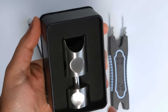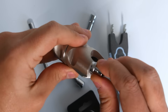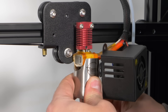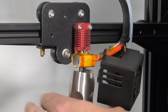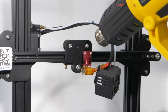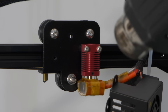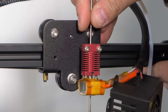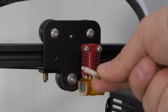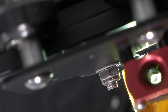I like to use the Zcatch, which is a tool I bought at IRF consisting of two sockets within each other — the outer one holds the nozzle block in place and the inner one gets a socket attached for the nozzle, which you can simply then twist. Once the nozzle is removed and you confirm that the filament path is blocked, the next step I usually take is to slightly heat up the heat break and heat sink with the heat gun, which will soften the filament jam inside. Just a couple of seconds should be fine. Then, using a long metal pin such as an ejector pin, simply insert it from the top of the hotend and push the jammed filament through. This process makes life a lot easier and doesn't involve completely disassembling the hotend.